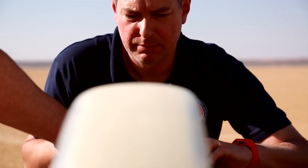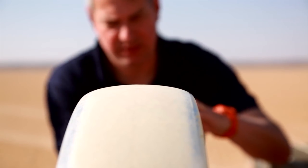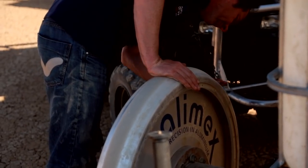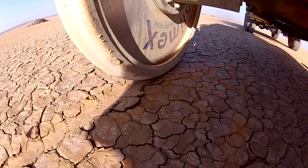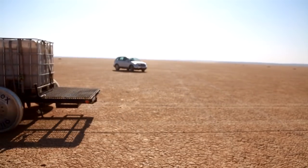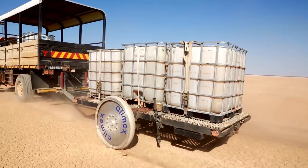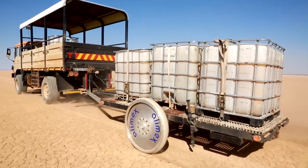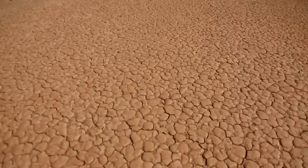The new profiles are flatter. The idea is to get them to run on the mud surface and not be so deeply embedded in the ground. If they run too shallow though, we'll lose lateral grip because they have to dig in a little bit. To start with, we're going to run the trailer down the desert for a couple of kilometres, then add more water ballast to the tanks and work our way up to the full car weight, monitoring how far the wheels go into the dirt as we increase weight.